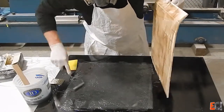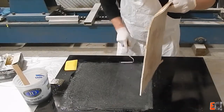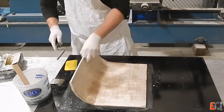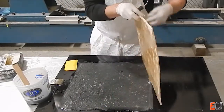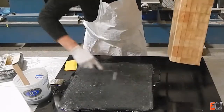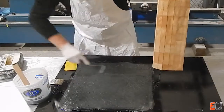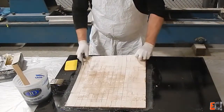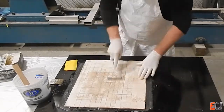You can see I pulled up a little bit of the chopped strand mat there — I'll go back over and smooth it out. Pulling it back up again was probably a bad idea. It would probably make some difference to put the core down in an unrolled style, pushing it down as you go trying to get air out the front, rather than just plopping it all down at once by rolling the top.